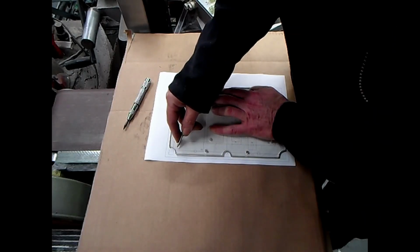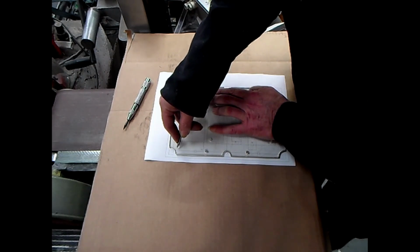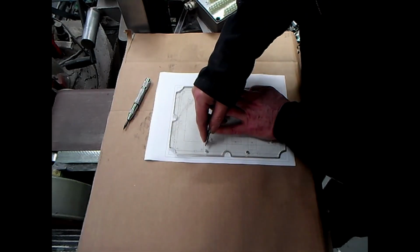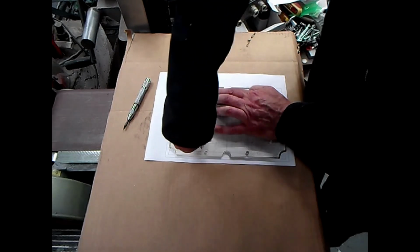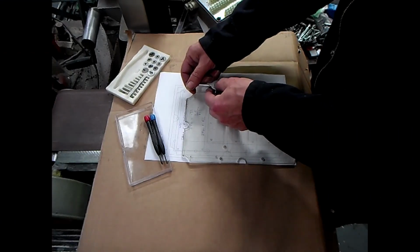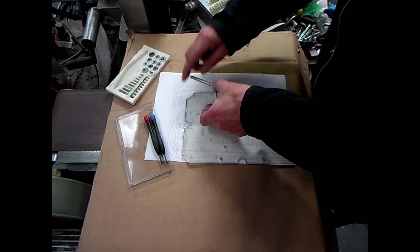When this spindle monitoring box is first turned on, it will flash to indicate that it needs to be calibrated. This is done by disconnecting or switching off the spindle at the motor. Then with the button held down, the spindle is powered on. With no current detected by the sensor, the output is sampled and averaged a number of times, and the value written to EEPROM, plus a bit to indicate that the calibration was done.